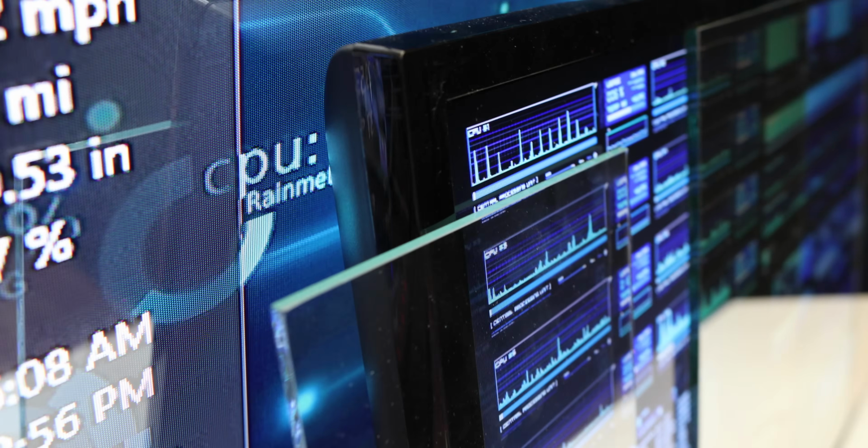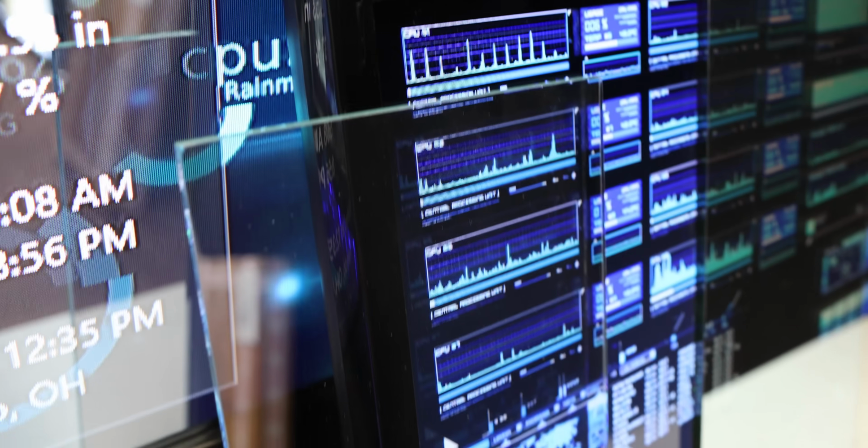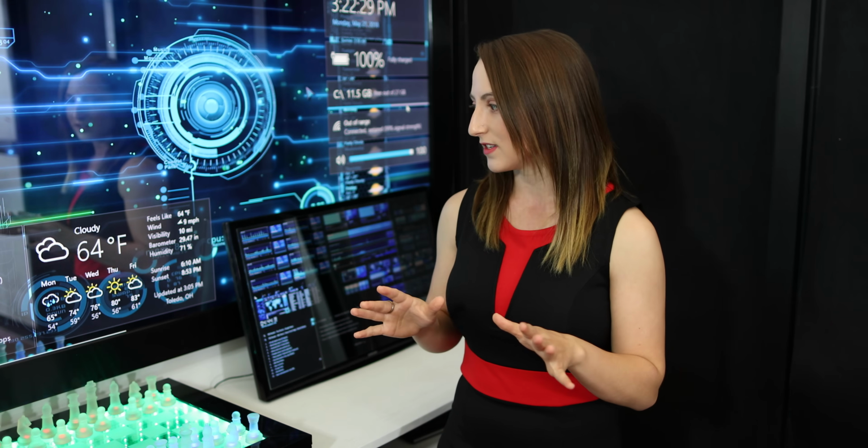If your smart mirror setup is a little bit different and you're framing it right to the viewable area of the screen, the dielectric mirror is actually the best mirror for the project. It's 70% transparent and 30% reflective, so you get that ultimate display quality coming through, but it also has a nice mirror reflection, as you see.